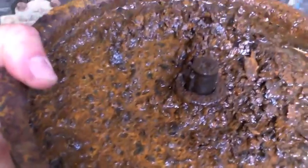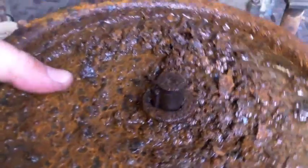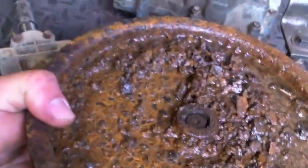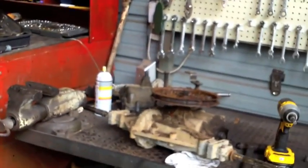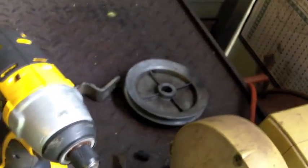We're going to compare the shaft heights because I think I see a problem, or maybe it's just sitting at a funky angle and we can adjust for that with the pulley. Okay guys, now we're back and you can see it's a good fit. I cleaned it out and opened up that set screw — that little locking screw — so I can adjust it to whatever height I need.